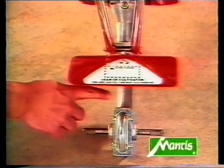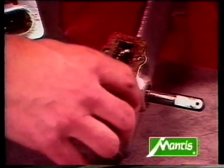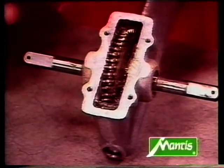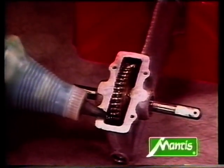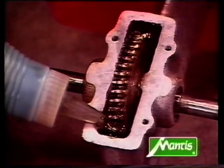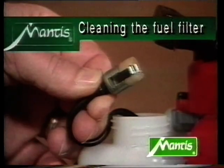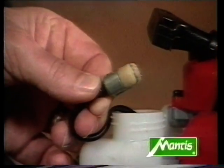Once a year, you should check the transmission grease inside the transmission housing. To do this, unscrew the cover from the transmission housing. The grease should more or less fill the gearbox — if this isn't the case, you'll need to top it up with lithium lubricant. This is the only possibility of adding lubricant in the cultivator; take care not to use too much. After the cultivator has been in use for some time, you should also check the fuel filter. Deposits of dirt can build up in the fuel tank and the filter. The filter is inside the tank — remove any deposits in the tank, on the filter itself, and in the fuel line.